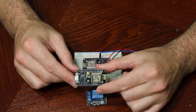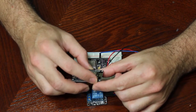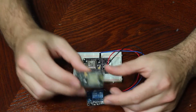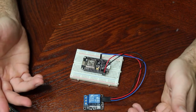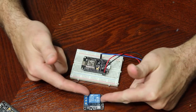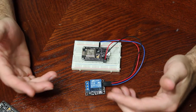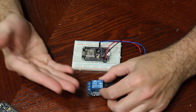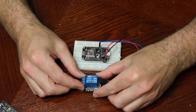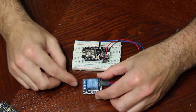After receiving them I realized, looking at the pin-out again, there is actually a 5-volt pin on the microcontroller, so I didn't need to order these ones — but I have five of them now. So I put one on the board and programmed it to act as a web server. When you go to a certain link on that web server, it will turn on this module for half a second and then turn it off. If you want to control a garage door, you can do that — a relay is technically overkill for a garage door and you could use a MOSFET controller, but this is an all-in-one unit that requires no soldering.